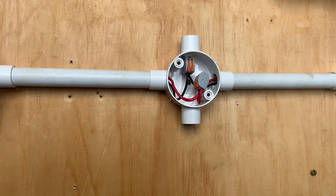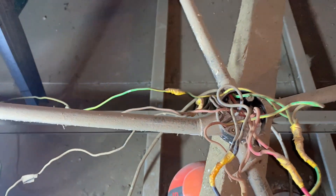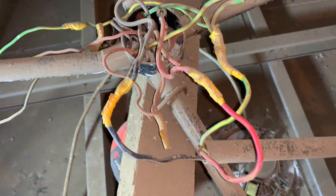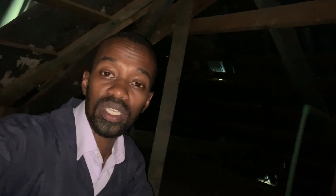This could be an ideal way of doing things, especially in the ceiling where there are extreme temperatures that affect any insulation tape on a joint — in most cases you find that they come out. Also there's another risk where you have rodents eating up the insulation, compromising that electrical joint. Electrical installation in the ceiling needs to be taken with a lot of care, as a lot of electricians are carrying out this work with carelessness.